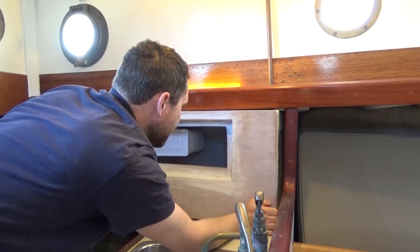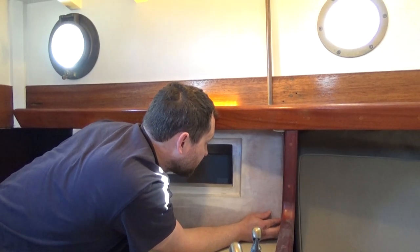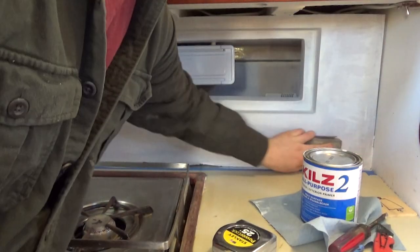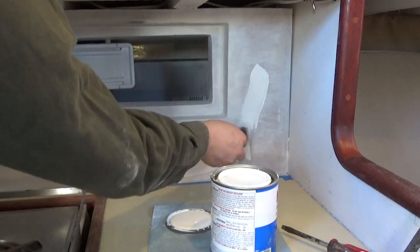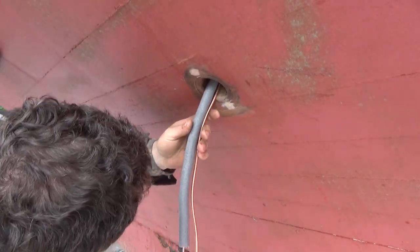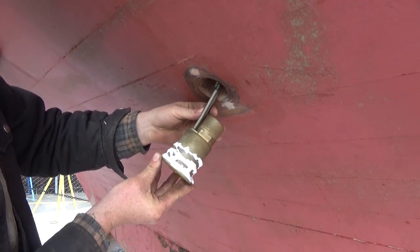The fridge is made up from rigid polyiso insulation, sheathed in a thin layer of plywood and fiberglass with tinted epoxy on the inside. It is very small, but it gives us a tiny freezer box as well. The fridge uses the sink through-hole fitting as a heat exchanger, giving water-cooled efficiency without requiring any water pump.